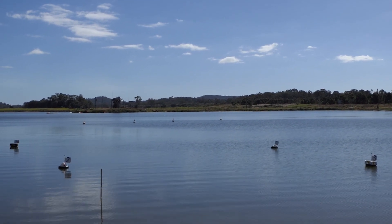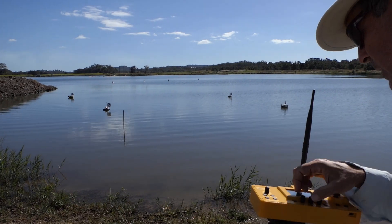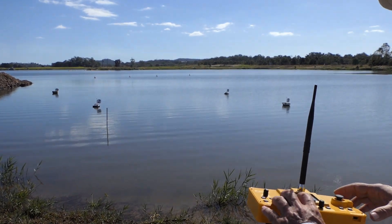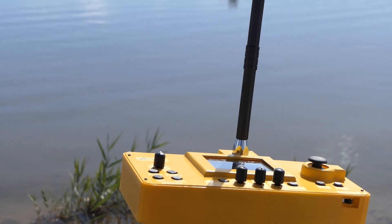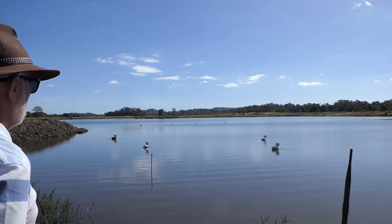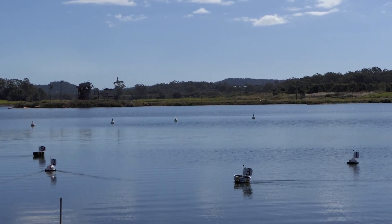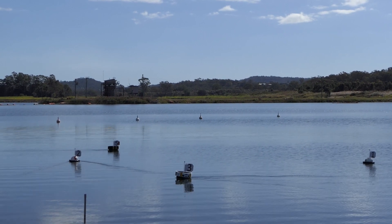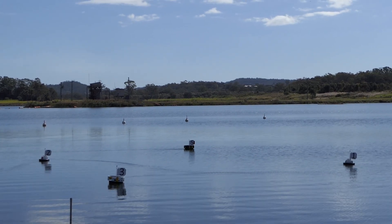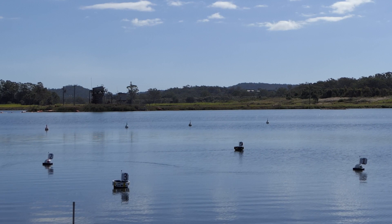There's your real-world equivalent of a big course rotation. Let's go back to the north again, and bring the start line a little bit closer together. The key question is how well do they stay on their designated station. These use the MQ10 Martak GPS, and their promise is around about a meter and a half from that position. As you see, if you get all the rest of the tuning right, they don't move much — and so do buoys that are already at anchor, so that's expected behavior.